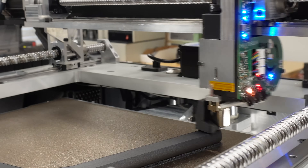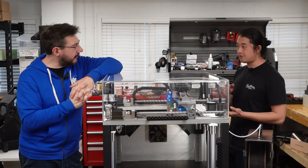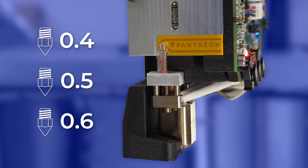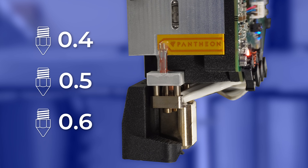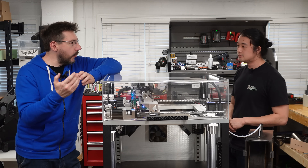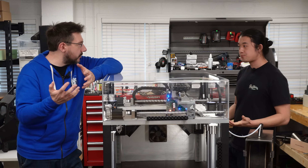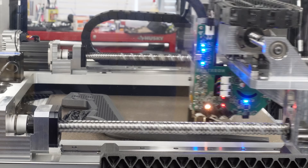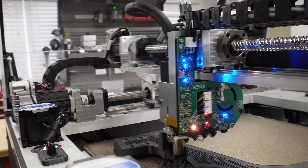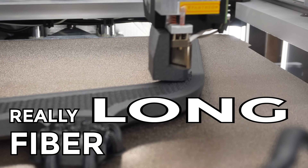So you're sending whatever materials you want through the nozzle — we have three nozzle options launching: a 0.4, a 0.5, and a 0.6. They plug into a couple different lengths of hot ends too. If you want to do perfect extrusion of materials, the material is going to require a different heater length or different nozzle size. We're printing carbon nylon right now using our mid-length hot end with a 0.5 nozzle to get really good tolerancing and to be jam-resistant, with really long fiber lengths.